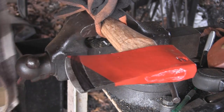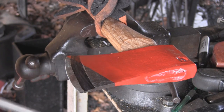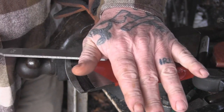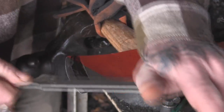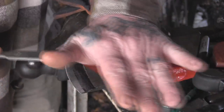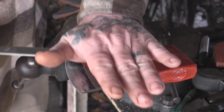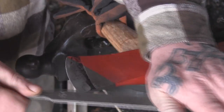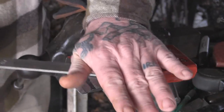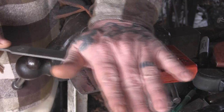So here's a line we've made on our axe with our black marker, and we're going to take our axe file. Now we're going to start on the rougher side. And when we put this axe on the bevel, we only want to cut in one direction, and that's this way. So we're going to cut along that line, just like this. And you can see I'm kind of sweeping up into that and curving into it just a little bit, just like this. And what that's doing is thinning this cheek out a little bit right here to give me a little bit better bite with the axe.